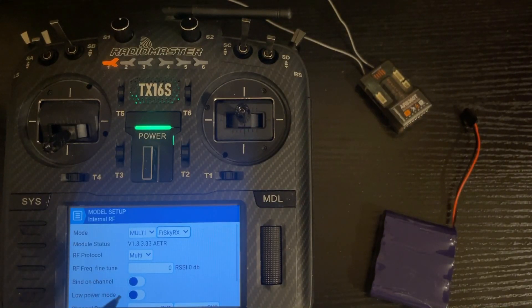Let's say you adjust to the left and you lose signal at 50, then adjust to the right and lose signal at negative 50. You take the median between those two numbers — in that case it would be zero. The way you know you've reached the endpoint is that the RSSI number will drop to a negative value until it loses signal and the radio says 'telemetry lost.' That's your endpoint on one side; repeat on the other side and use the middle value. So if it was zero on one side and negative 50 on the other, you'd use negative 25.